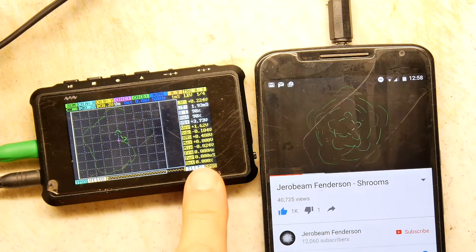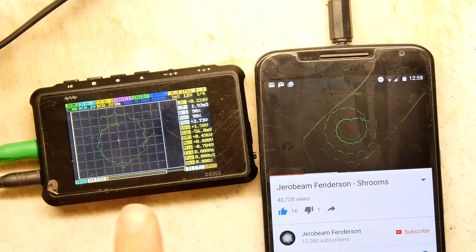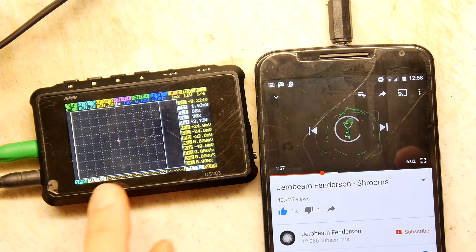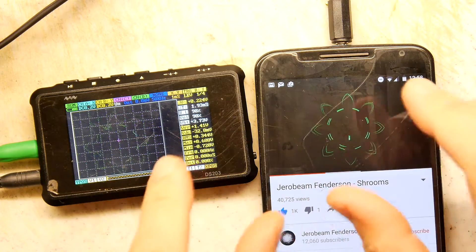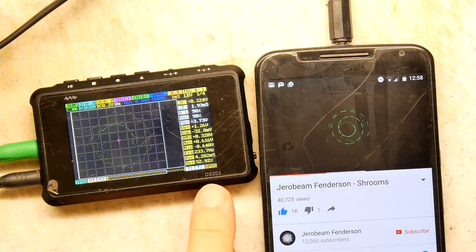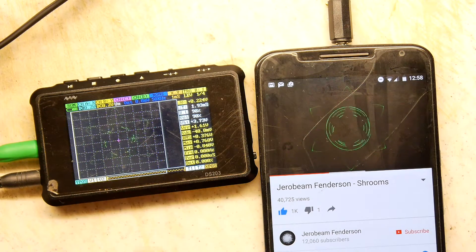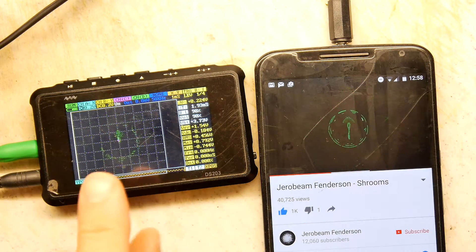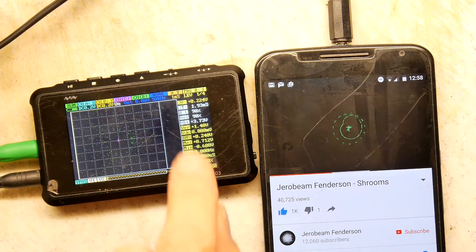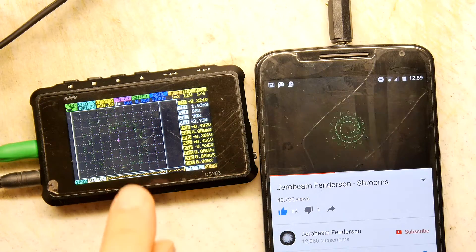This is so useful to me. This DS203 — I've had it for a long time. You can see the green probe that's in one of my other videos where I fixed it. It's just a really nice little digital storage scope, and the fact that it's having a fair old attempt at displaying these graphics is just so impressive. If you have one of these, I'm going to try to leave a link below — it's on GitHub. There is an alternate firmware and it does seem easier to use. They've really simplified the menus in the normal functions. In the XY function you have this sort of bar back again, because that's more or less a square screen, but when you've got it in regular mode it just cleans that up. Different trigger modes — very cute.